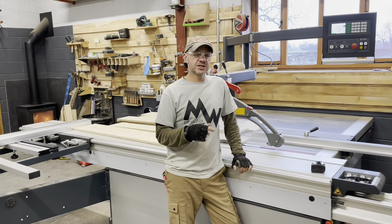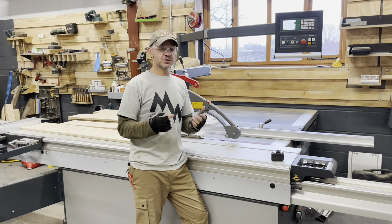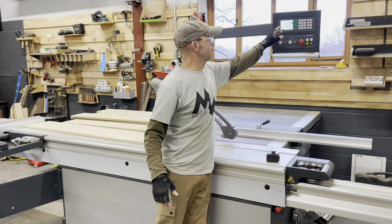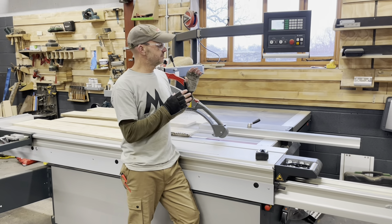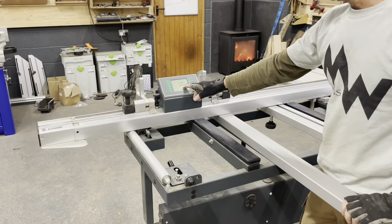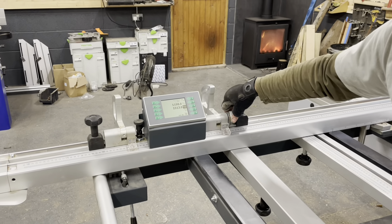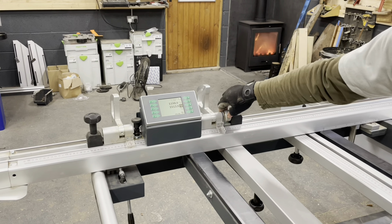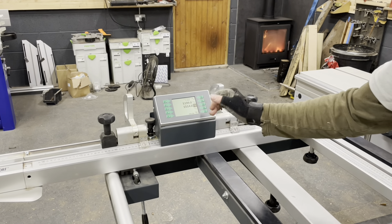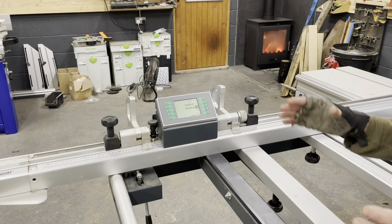One of the major things about getting a CNC style saw — and in fact everything in the shop as I show you the new gear — is that it's all numerical control. It means we can carry on making this little unit and then come back knowing that if we go to 182mm, if we forgot to do a shelf or want to do an extra cut, it's going to be the same every time. That's the main difference versus nudging fences by eye. Even with a reading of 1514.0, if you move it even slightly it's not critical for rough work, but if you're doing super fine stuff it's really good to know that every time you dial in 1514 it's exact — rather than being a couple under one day and a couple over a few days later, which creates massive discrepancies especially on big shelving systems.